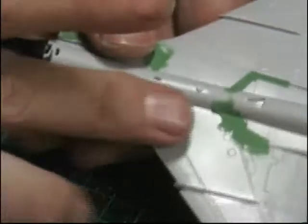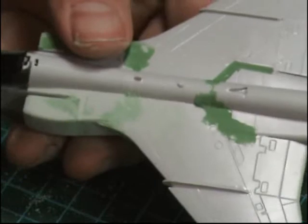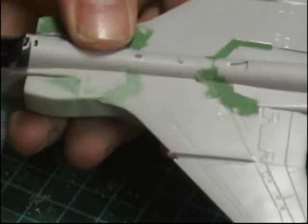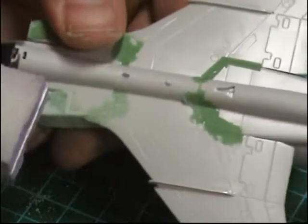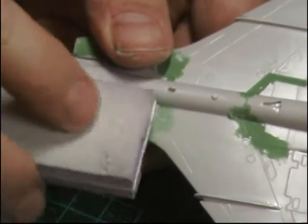So there we go, you get to this sort of stage. Then if you get your sanding sponges, take quite a coarse one to start with, and the same thing, keep it flat and go against. Now the thing is, when you're doing it, don't go in front like this and then up, because what you actually do is make a step when it hits. Make sure it's completely covering it, and then just keep it flat on the top. Yeah, it will just make sanding a lot easier.